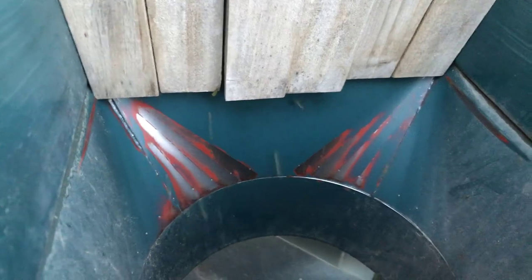This is the after suction, which is on the bottom of the cleaner — not much coming off of there. This is the scalping screen, the round hole screen, so this is what's coming off above the hemp — just big chunks of stalk and that kind of junk. I'm not using my indent right now because the hemp tends to roll to the bottom and goes out in the screen.